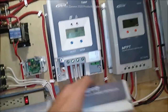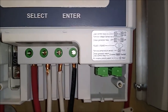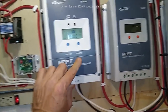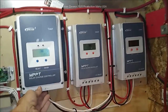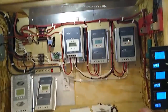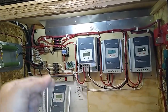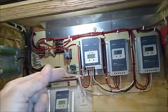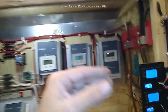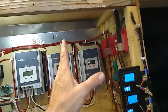You can remotely control load on/off and things like that. The MPPT is an important feature when you don't want to buy a lot more solar, or when dealing with reduced solar capacity — which is happening right now. If you have a chance to get away from PWM (pulse width modulation) and go to an MPPT, you don't have to worry about that conversion loss anymore.